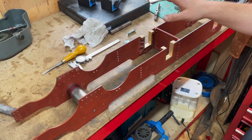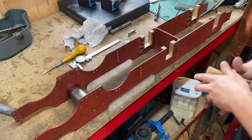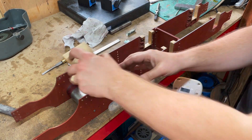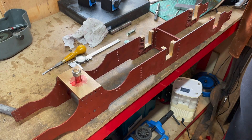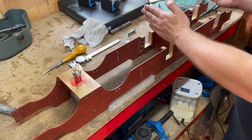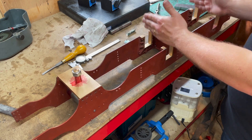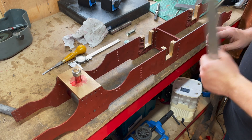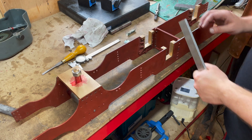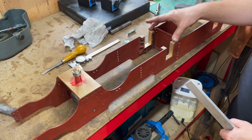Here we have the frames laid out on my workbench. It's not flat so you might hear a bit of rocking but that's just what it is. The spacer is in there and I can put the bogey bolster in on top - that works out nicely. The main issue is to ensure that these horns are perpendicular to the frames and that they are straight. They are about 1,270 thou in width, so they're 20 thou over the one and a quarter inches they're meant to be.